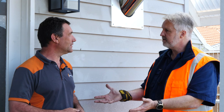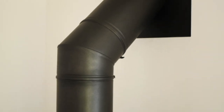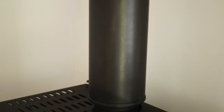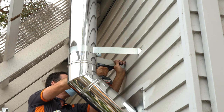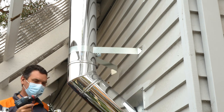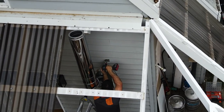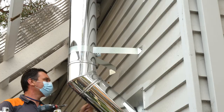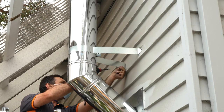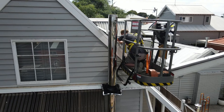One thing you noticed putting this in — I know you put a lot of these kits when you were plumbing in England — it's really nice to have it available in Australia. That weight, there's a lot of flue on that heater and all that weight is sitting on top of the heater. How did you find bracing it without having to hold that weight up? The majority of the loading is on the heater, but it actually held itself vertically putting the 45-degree wall penetration through. So then we could just put a wall bracket on, and when we got up to roof level, we put bracing on to take some of that loading.